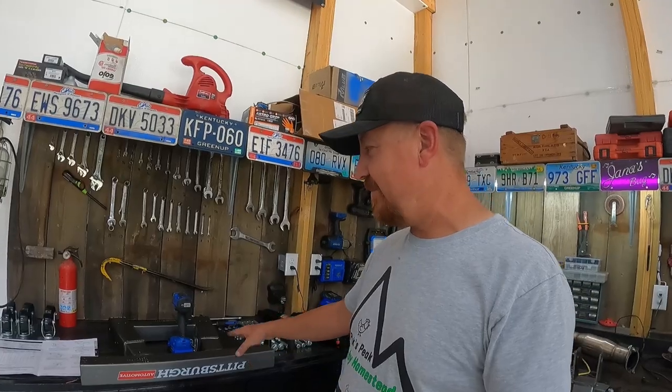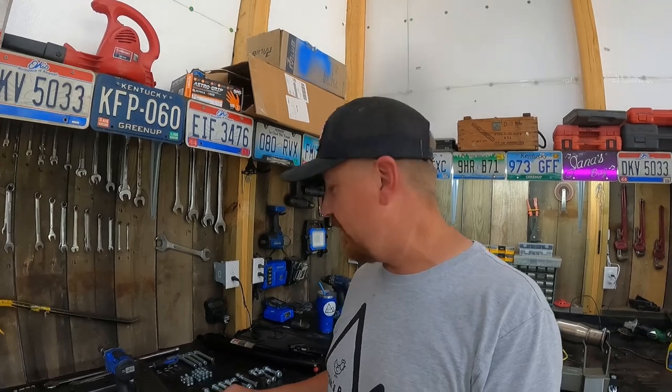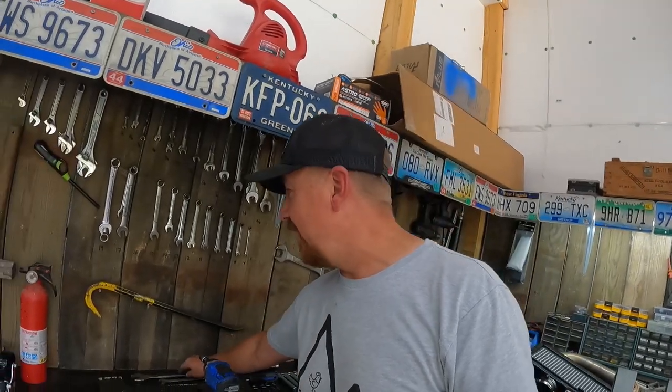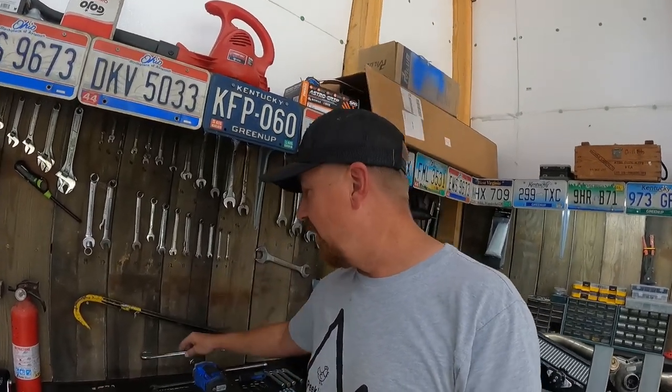The first thing we're going to do is get this main plate, this triangle frame, and bolt the casters on it. You have six casters - four of them are large and two are small - so be sure you follow the instructions and put the right ones in the right place. You're going to need a 14mm wrench and socket for the casters, and a 24mm socket for the biggest bolts. I didn't have a metric 24 wrench but I have a 15/16 which fits.